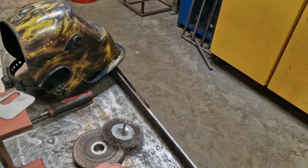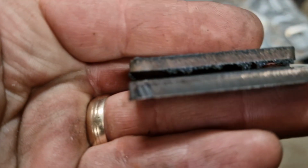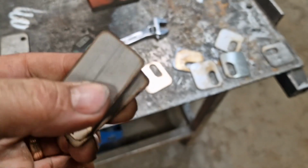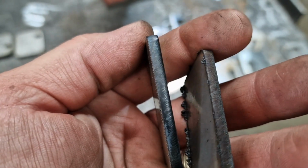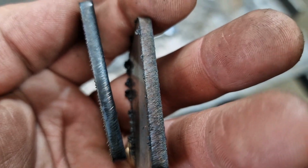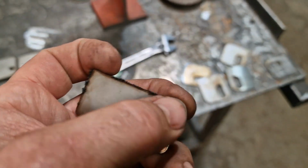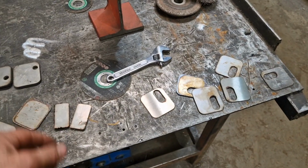What's the takeaway? Well, I think that if you look at those two parts, there's a definite difference, completely untouched. You can tell there's a difference there straight away. On the left, look, is nitrogen. That tiny bit of bluing is a lot smoother cut. And the oxygen, or the air, if you like, direct from the compressor, does leave it pretty shitty. So there we go.